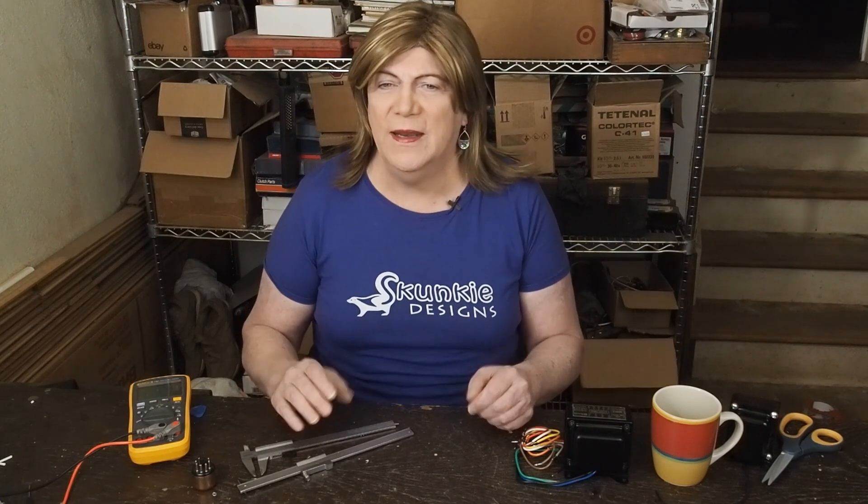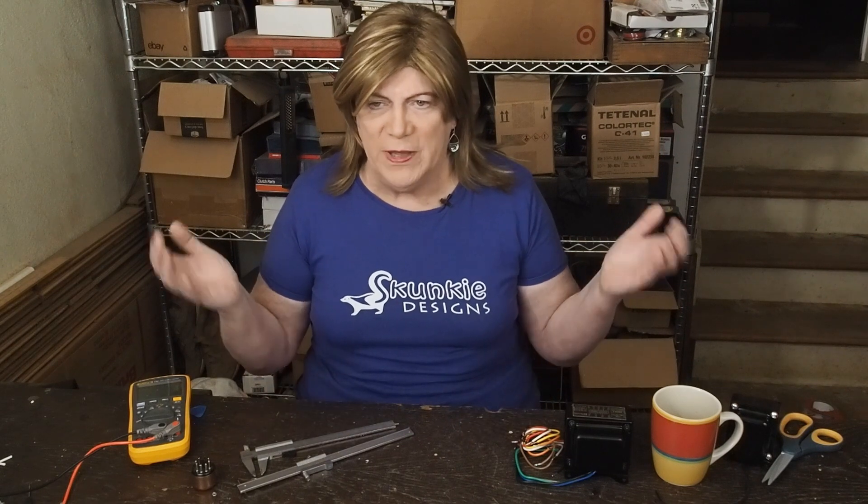This is all assuming we're talking about both amps with Skokie mods done to them. Both amps have serious design flaws out of the box, and if you're not a DIYer and you're not going to go inside and do these modifications and change the way the circuits are wired, I can't recommend buying either one. They're high distortion, have nowhere near the rated power output — either one struggles to make 2 watts. Even with really efficient speakers, there are better-sounding amps out there, and there's no reason to spend $500, much less $1,000, to get 2 watts of power.